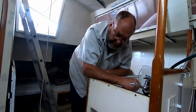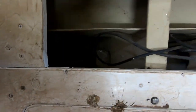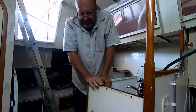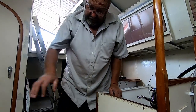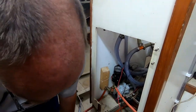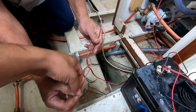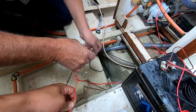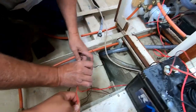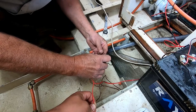Now we want to test the float switch, which is automatic, to the bilge pump. The float switch is actually mounted a bit higher, so when the water starts filling up it won't activate that switch, but at a certain level it will activate the float switch. We run the positive through the switch — positive that side, and the negative would go to the negative here, which I assume is black. Assumption is the mother of all stuff-ups, but let's try it. So it should start because now the switch is actually activated — it should start pumping immediately. And there it does.